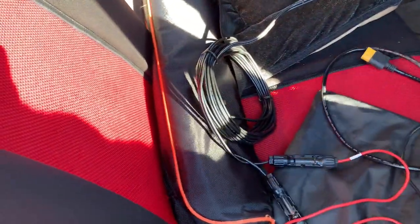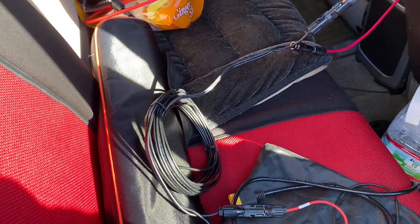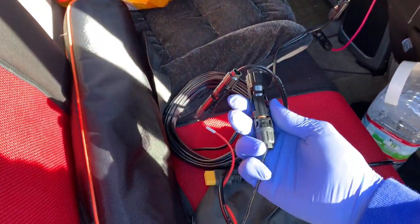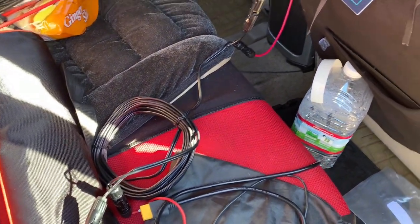It went from 56% to 90% — that's a good amount of charge. What I want to keep in mind is that whether it's a 14 or 10 gauge wire, it's not going to drop off that much power, and it'll still keep the charge going with a 20-foot line. Later on I'll try connecting two of these 20-foot cables together and see how much of a drop-off that brings — I don't think it'll be much, it'll still charge up.